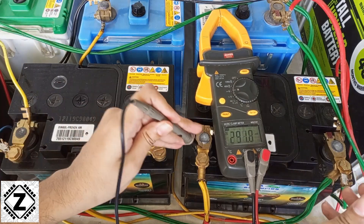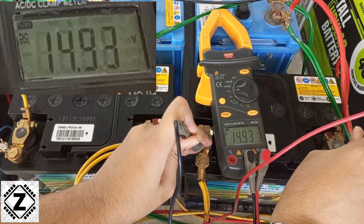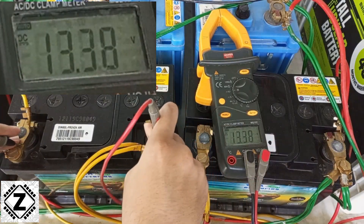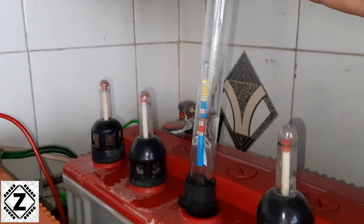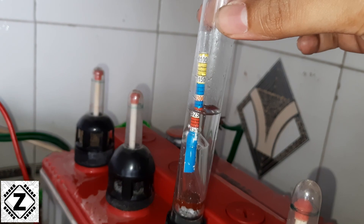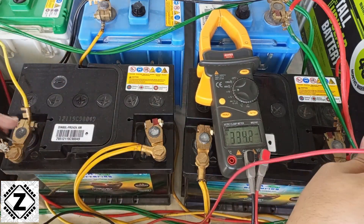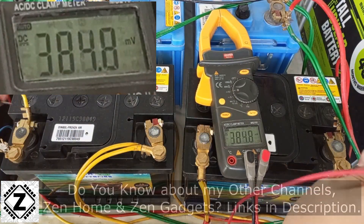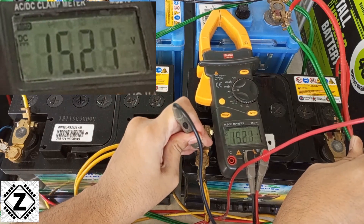The problem starts here. Let's check individual batteries. This one is at 15 volts — that is really, really high. This particular poor battery is being cooked; it's being overcharged at 15 volts. And this other battery over here is not getting enough voltage — it's at just 13.3 volts. For proper backup these batteries have to be charged at 14.4 volts, which is the peak charging voltage. Even though the total bank reads a good 28-point-something volts, this is what your inverter sees — it thinks the batteries are happy, but it does not see the individual imbalance.